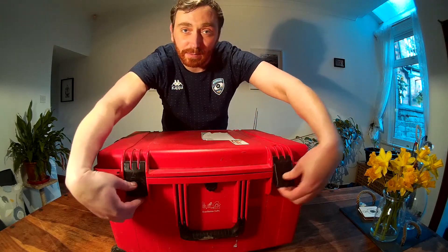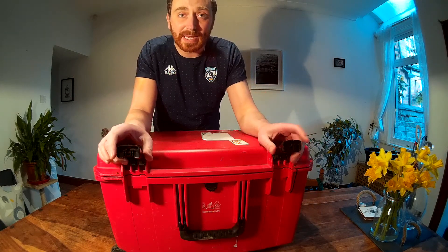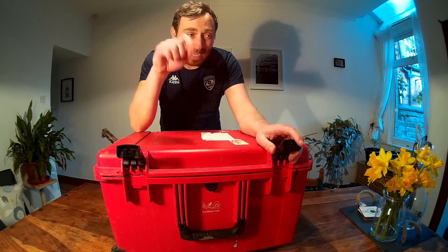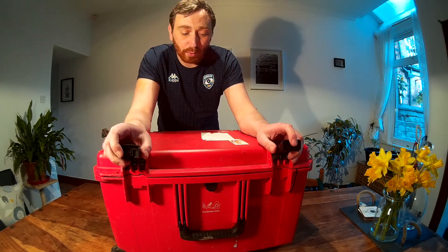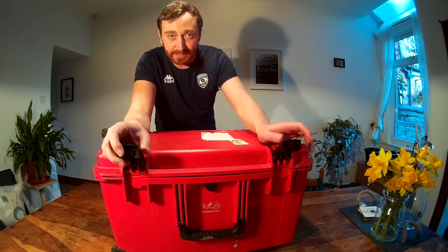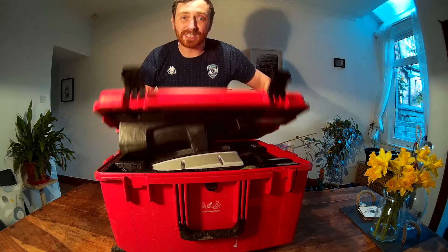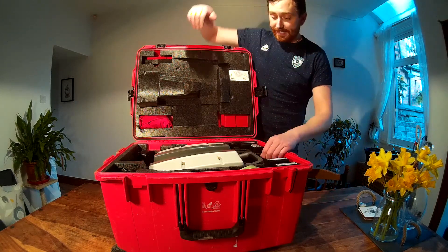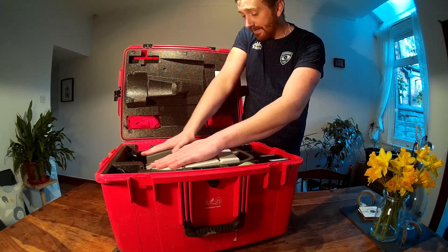If you do use them in the rain you're probably going to get terrible results though. So what is a 3D scanner? It's going to shoot a million points a second, spinning around on its axis both vertically and horizontally. You end up with a point cloud — millions and millions of points. It also takes photos and colors the points in, so you get a photorealistic point cloud.